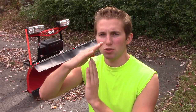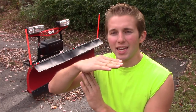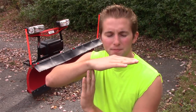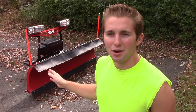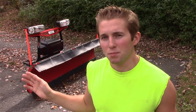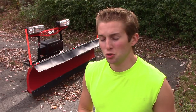The problem with shoes on pavement is say you're going up a contour or a hill a little bit, and as you come back around, your front blade will not make contact with the ground because the shoe will be holding the plow up. So you'll actually miss a little bit of snow — you'll skim right over it. Whenever I'm plowing pavement, I always keep my shoes up so that cutting edge stays on the ground. It wears down the cutting edge faster, but it provides a better, cleaner swipe.